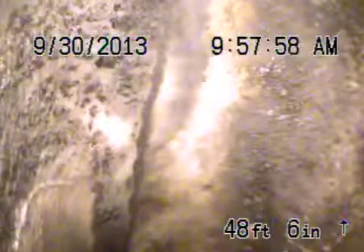Here we are at 3321 Troy Drive in Los Angeles. We're at the city, so we're running from a 3-inch clean-out underneath the house. We'll go ahead and bring the camera back. We located this across about 6 feet deep. So this will be the turn into the city. We're going to slowly bring it back.